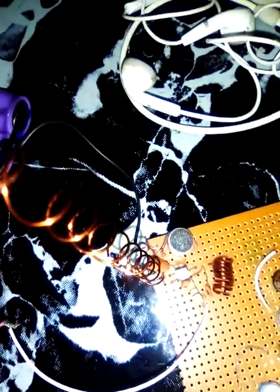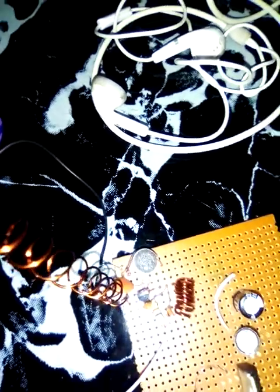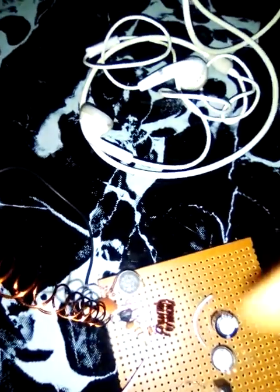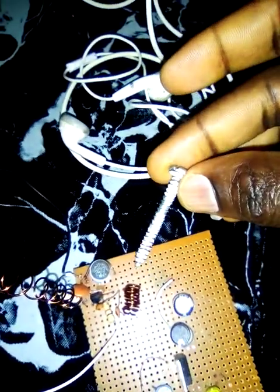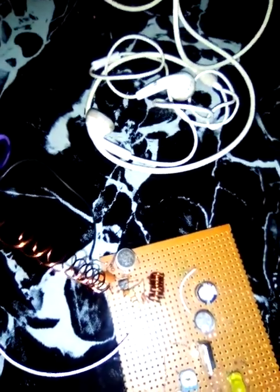Welcome on board. This is our simple FM transmitter. I'm going to explain everything about how to make it. I'm using a BC547 transistor, and there's a coil that works together with a capacitor to give us our FM frequency. You can use a metal piece like this — when you put it inside the coil, it adjusts the frequency. This is the battery that is powering it.